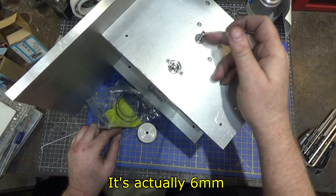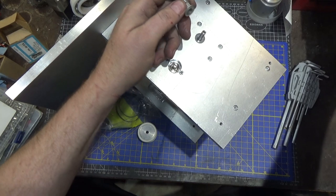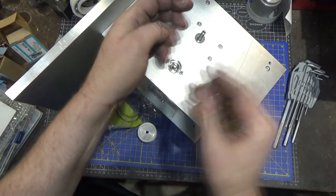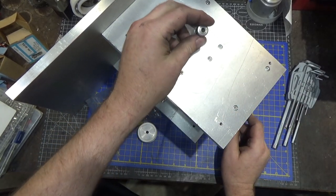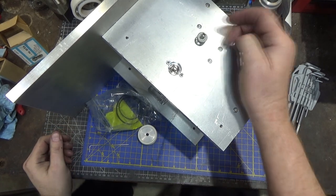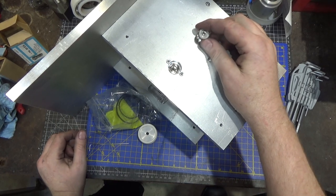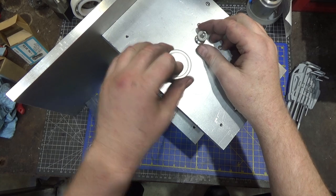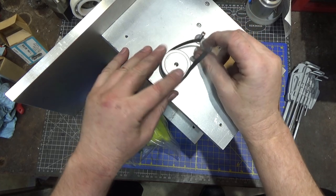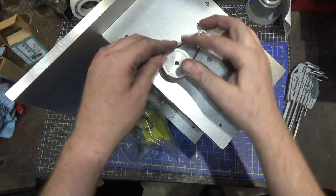Okay. So it looks like I might have to go and turn the shaft yet again. I think rather than reduce the shaft anymore, I'm going to ream it instead, because the shaft I made 0.249. So I'm going to ream this to 250 or 251. I'll be right back. All right, reamed this guy out to 251. It's a tiny bit sloppy. I think I used a manual drill, so that was not an ideal solution for this. Now I believe I have the exact right size. If I did all my calculations correctly, this should just slide right on each one of these.